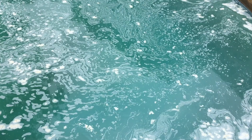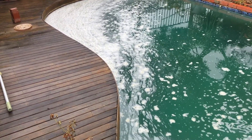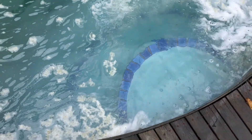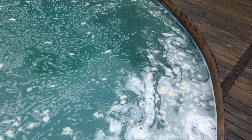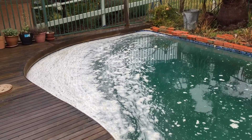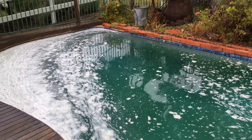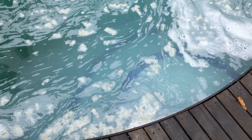Here is the response on that pool after about another half hour of filtration with those chemicals in it. We're getting foaming on the top — foaming is very consistent with adding benzalkonium chloride, so don't panic about that. You can see the steps now — that's a dramatic change from what it was. I'll come back to this pool in a few days and give it a vacuum to waste, because all of that algae will settle down. The algae stuck on the walls — I was brushing it but it wasn't coming off — that will then brush and come off next time around. This is why I use the copper-based algaecide, because it hangs around long-term and keeps getting algae spores under control. That pool's looking fantastic.